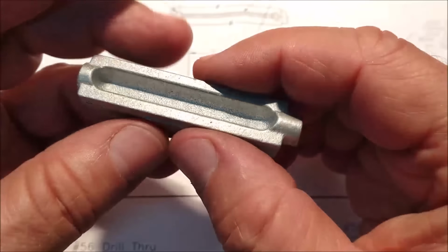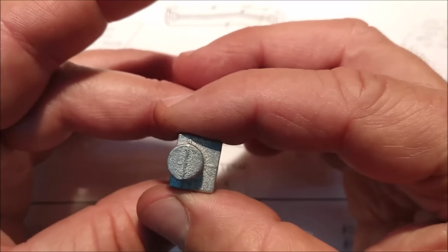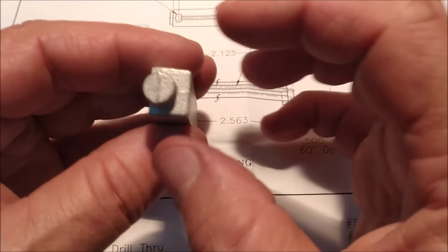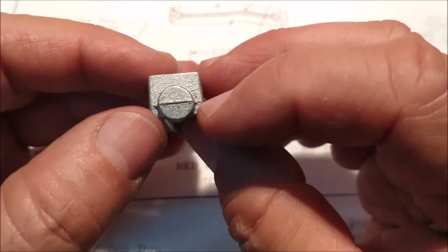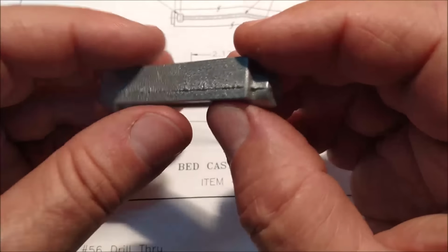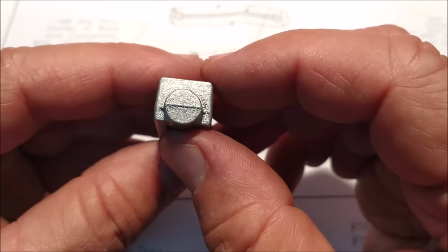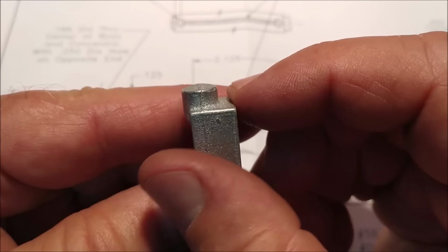Material does come off of all sides. Everything is going to be nice and true when it's done. So it's going to be relatively easy to hold. But you don't want to hold over dovetails, so that will probably be the last thing to do. The dovetail may cut into this boss on the end as well as this one. And if that does take place, well, then I'll trim them down so that you can't see any dig marks in it. At least superficially, that is the plan.